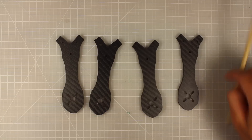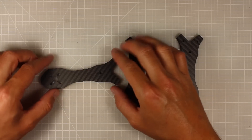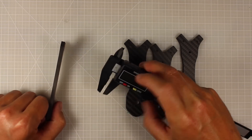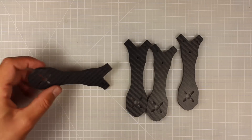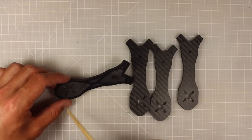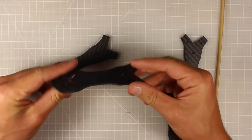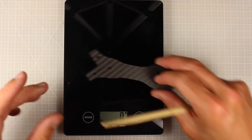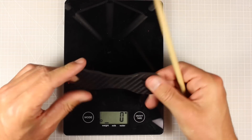These are probably the most high-tech arms I have seen. Besides looking extremely cool, look how thick these things are - 5 millimeters thick. We have 5 millimeter thick carbon arms, milled out a little bit to save weight and allow screws to go through. These are fantastic, really really strong - I highly doubt anybody is going to break these. They're made for 2200 motors, which come with this kit anyway. Each individual arm weighs 16 grams, which is pretty light for a 5 millimeter arm.